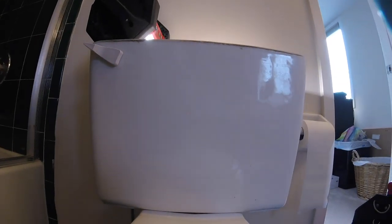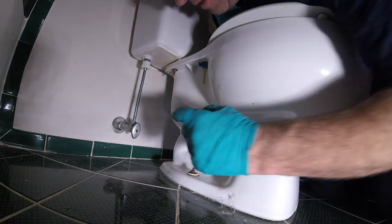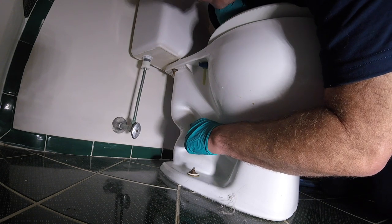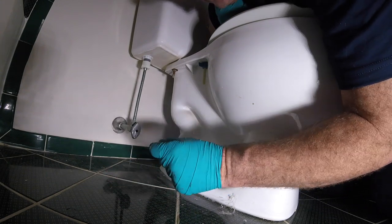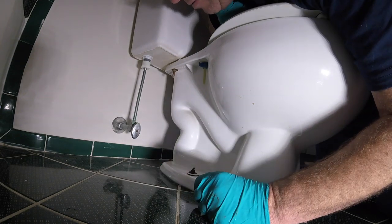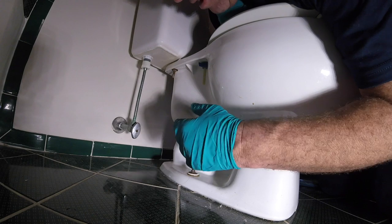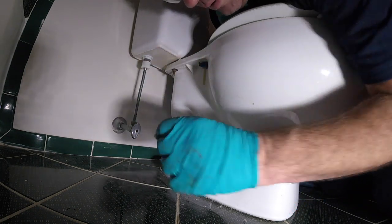Any leaks I missed, you pros out there? I once had a brand-new toilet — brand spanking new — installed, and it had a sand hole with a drip of water coming out the side of the china when you flushed it — a factory defect. A piece of sand hadn't been glazed over, it popped, and it looked like a needle hole inside the toilet tank. That happened to me once in my lifetime. And of course, always keep an eye out for cracked tanks and cracked bowls.